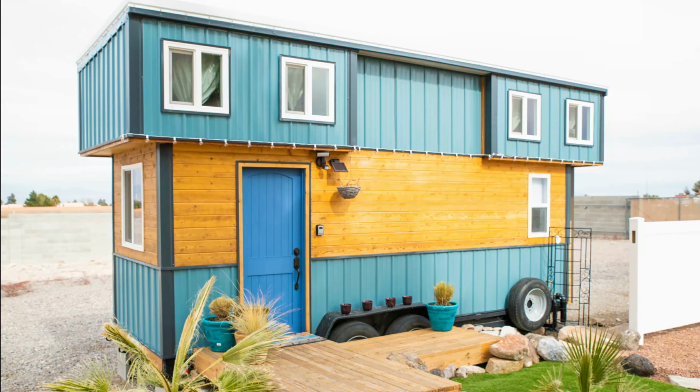For our first tiny home build, we were able to score a trailer for $2,200, and what we used was a heavy duty hauler trailer. It had two 8,000-pound axles and diamond plated steel sheathing on the bottom, so we were able to just frame our subfloor right onto the top of the trailer. Within this specific estimate that we're going to work through together, the trailer cost I have added to the overall cost is going to be the $2,200.